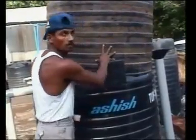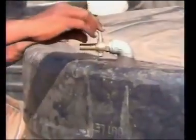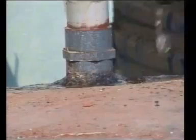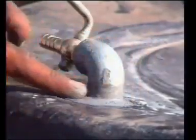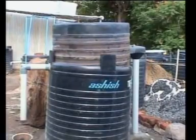Then place the gas holder tank into the larger fermenter tank after opening the gas cock. After the gas holder has sunk halfway into the fermenter tank, close the gas cock. If the gas holder continues to sink after shutting the gas cock, it indicates that the joints are leaking air. The joints should be tested with soap water — a leaky joint will produce soap bubbles. If the gas holder remains floating at the same level for more than 10 to 12 hours, it means all joints are airtight.